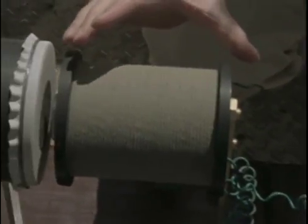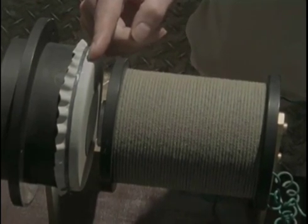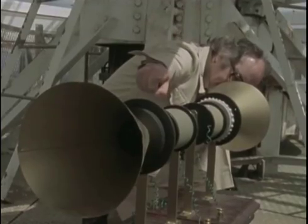This fluctuating current fluctuates along a wire until it reaches an identical setup, where — because it's a fluctuating current — it makes a fluctuating magnetic field, and that causes another metal diaphragm to vibrate in exactly the same pattern as the first one. And when it does that, it makes a noise in that cone. So, what you yell in here comes out there.